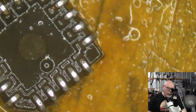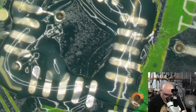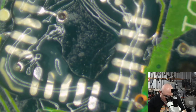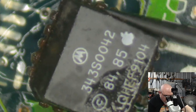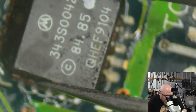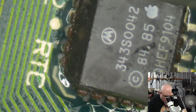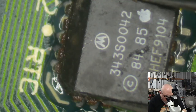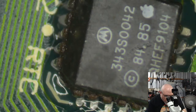Okay. Now it's time to put this component back onto the board. And that's where it's going. I've mentioned before with the PLCC chips, they have a dot. Just there. And I'm going to line that dot up with a dot screen printed on the board. Just there. Dot for dot. And let's get that positioned as best I can. I'll probably hold it with my finger, but...